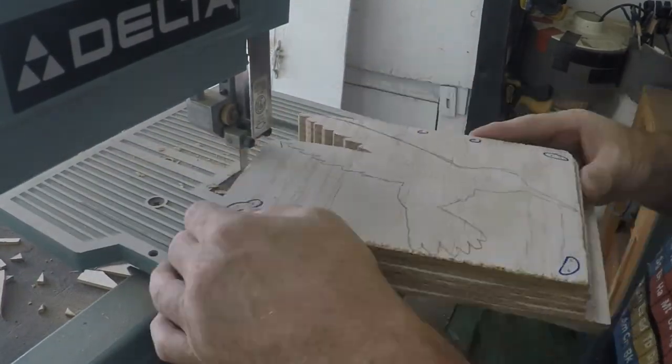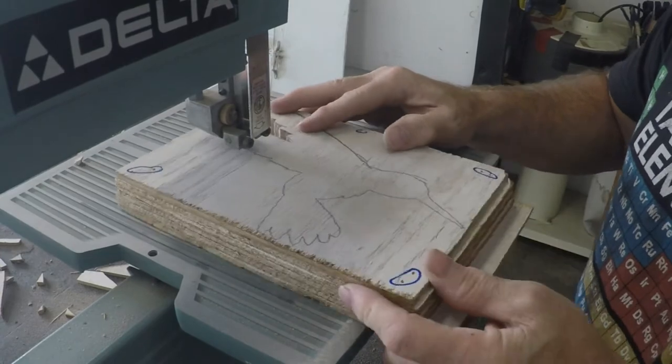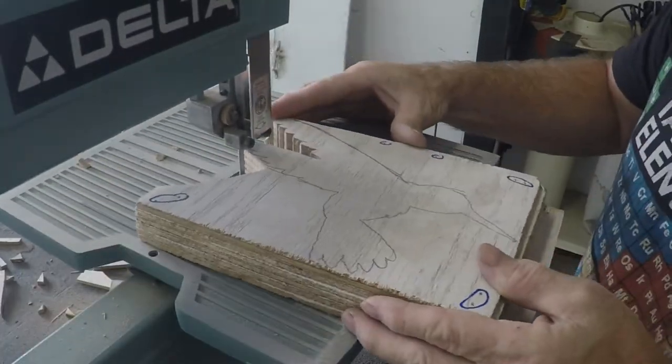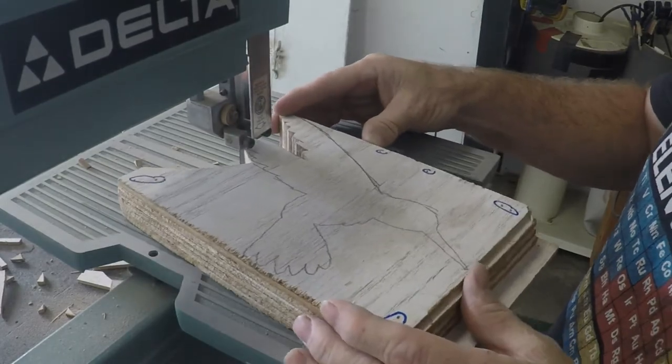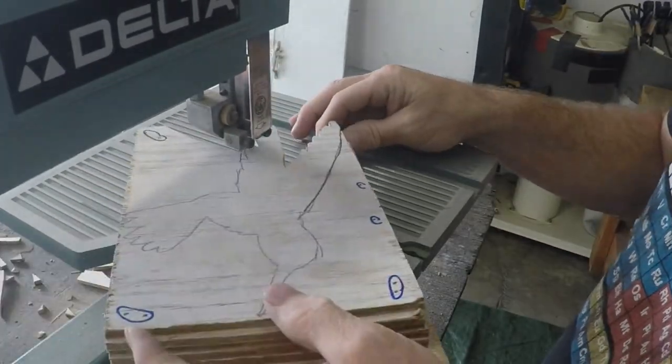The reason why I didn't finish this cut on top is that while you're cutting, you need to arrange it so that the brad nails stay in place as long as possible. Remember, the nails are what's holding the plywood together, so you're cutting them all out at the same time. So before you start, put a little thought into where you're going to cut.